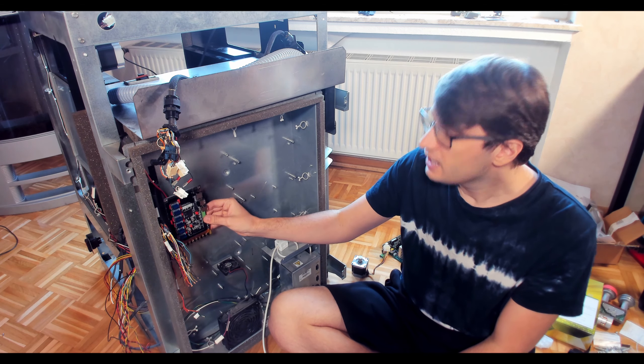The reason I'm going with the TMC5161 specifically is because I'm using big motors that need 3 amps of current draw. These drivers go up to 3.5A RMS, so they'll be able to drive the motors with enough current. I also have all the IOs necessary to control the whole printer and all the sensors. I also bought these standoffs — they are M2 and M2.5.